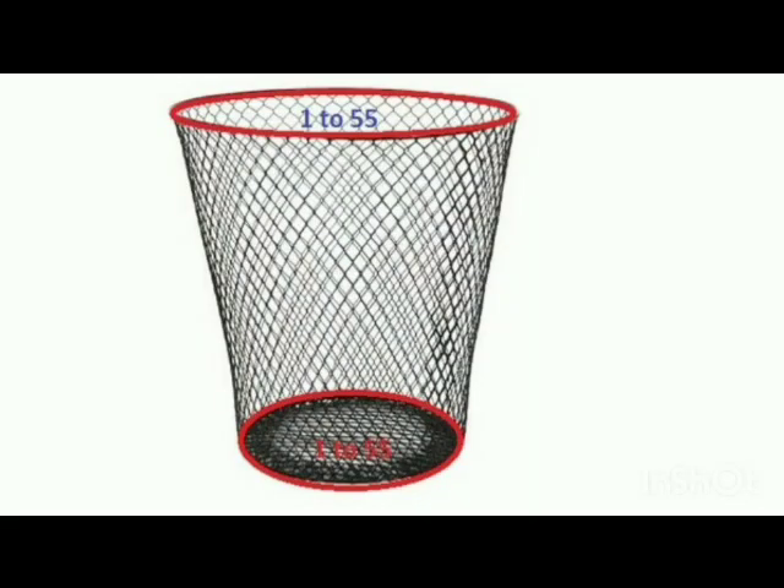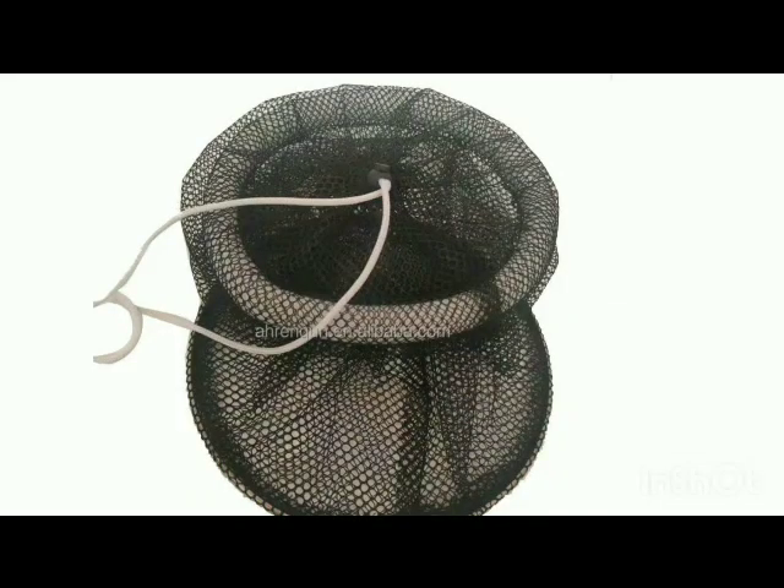At the base, take another aluminium ring and tie it to another end of the fishing net. A catch bag will thus be created. Hang one stone on each side of the catch bag. At the mouth of the catch bag, fix four small rings in the wooden circular frame. Through each ring, allow a bigger circular metal ring to pass through and fix a propeller.